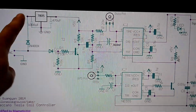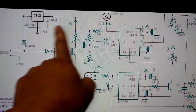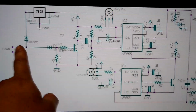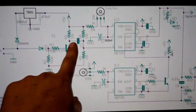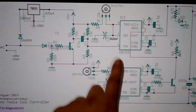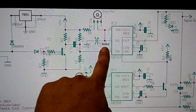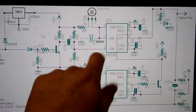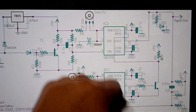So coming off there with a diode powering that, you've got that filtered, and it's powering the 555s and all that. Then you're coming in here, this is providing your signal to the zero crossing detector here. And then I've just added this change here on the C4 capacitor. This is your duty cycle pot. He had it originally set to max out at the quarter wave. This just sets it to max out about at the full half wave.